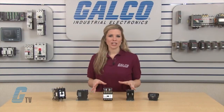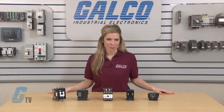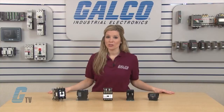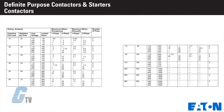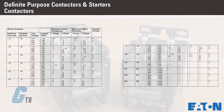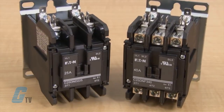They are subject to stringent quality assurance inspections and testing procedures. They are available in single, two, three and four pole configurations with current ratings from 15 to 360 amps. The contactors are dual rated for inductive and resistive ratings as well as for horsepower and kilowatt ratings. Pressure plates and quick connects are standard on 15 to 30 amp contactors, as lugs and quick connects are standard on 40 amp and above models.